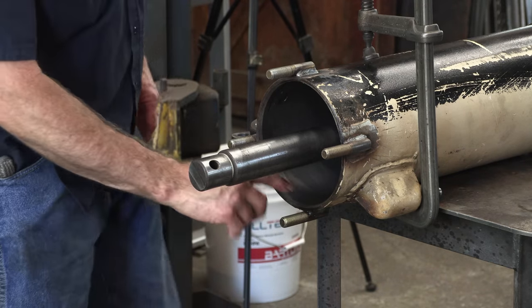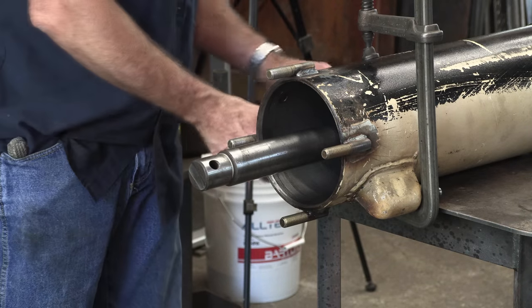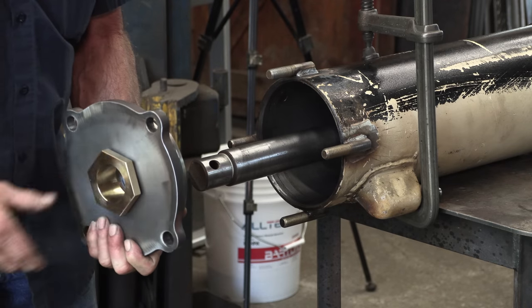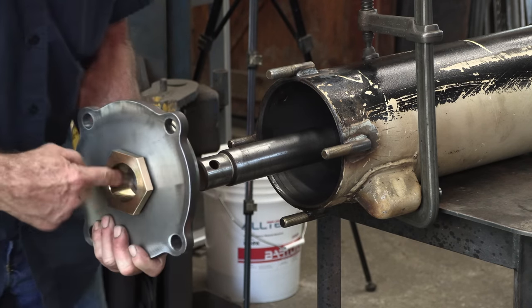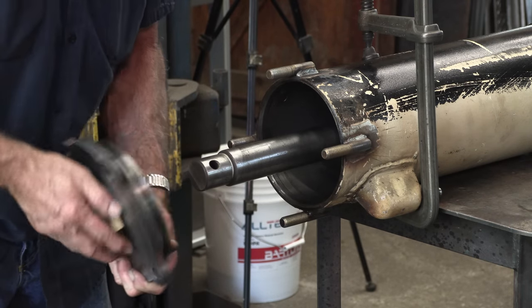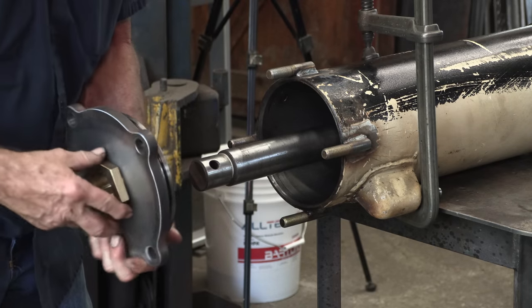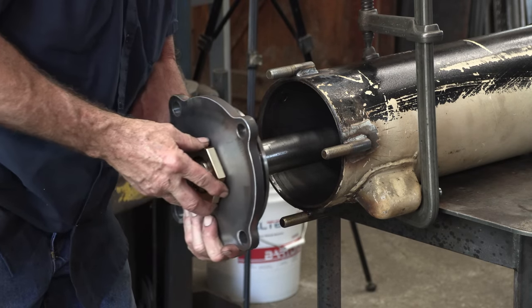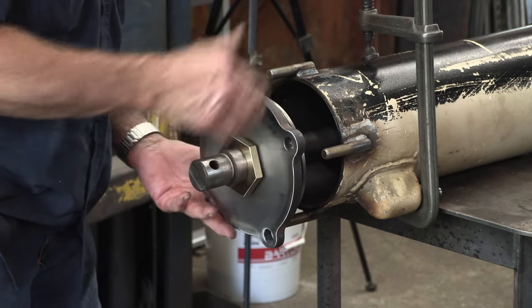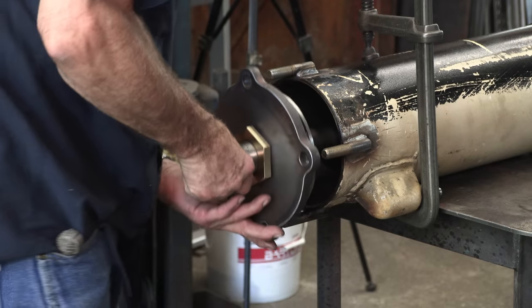I said, but there's no need for that. And it kind of moved me along a little bit faster. All right. And then we made the nut. You saw some of that. And the bore of this is the guide for the ram, okay? Because this surface here doesn't touch it, the packing, and this is the bushing guide, and it was worn out as well. And probably more so because it was bent, or the ram was bent, and then it was doing some wearing. Okay.